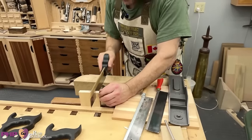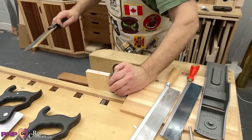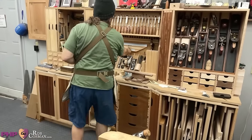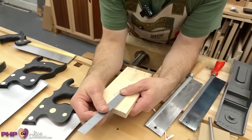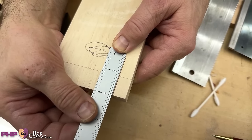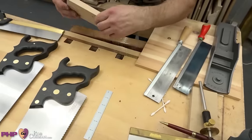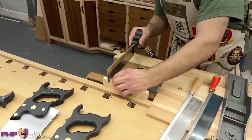So if your saw will cut perfectly straight, you just make a cut in the board, go down as far as it'll go. Then you're going to take a straight edge. And we're going to put that straight edge beside that cut, and we're going to see, is it straight? Well, it certainly appears to be, meaning it's not wavy at all. May not be perfectly plumb, although it looks pretty good. So I'm going to now remove that piece, cut it right here.